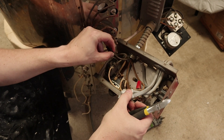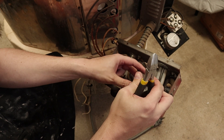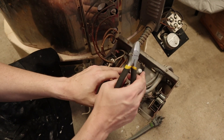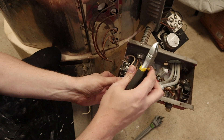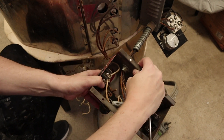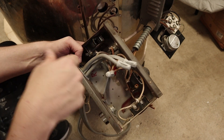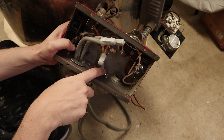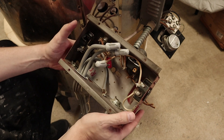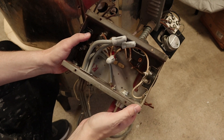Those four wires free the kiln sitter. Now there's a piece of conduit. This top plug is really in bad shape. Here's the power cord coming in — the neutral line is actually connected to the case, which is very dangerous. There's also a pilot light here. I suspect what I'm going to do is remove all this stuff. I need a new cord anyway, and I want to replace the switches with relays, so I think this all goes away.